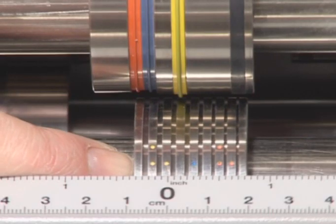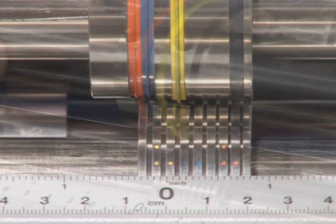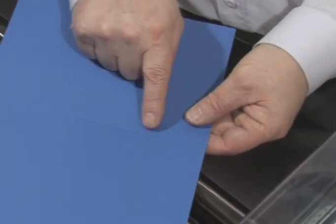Matching the male gripper crease with one of the corresponding choices of dot-coded grooves beneath will guarantee instantaneous results, to the quality that is only reached by flatbed cylinder methods of creasing. Run a sheet through and check the position and depth of crease.